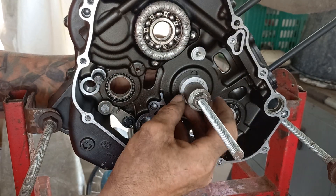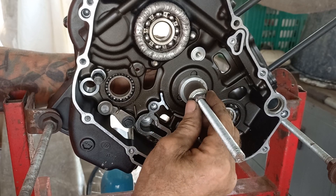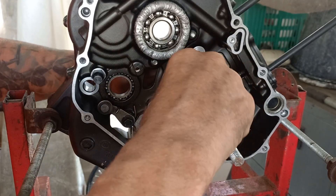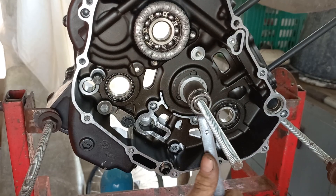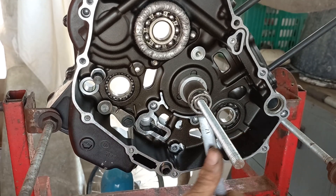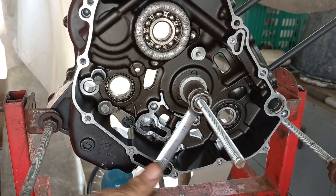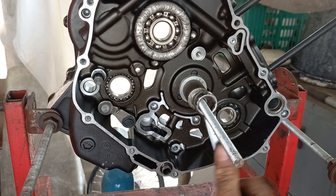Get all your jig ready and then centralize it — make sure it's all nice and central. Try to make sure the washers are the same diameter as the bar. There's a wheel spacer there which is a bit bigger but it's kind of central. Make sure the back hasn't slipped onto the neck around the case — mine just did, so I checked it. Then start winding it up. You should hear a ping as the bearing starts to move.